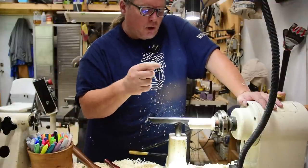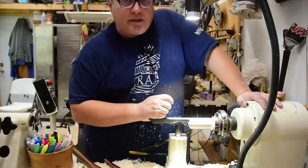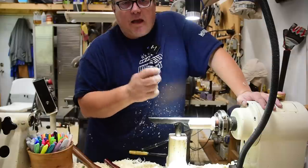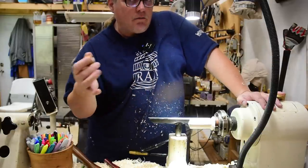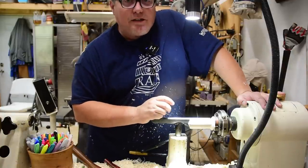Sometimes I'll grab some sandpaper and just kind of rub off the tip a little bit — you want that tip to be flat or slightly curved but not pointed at all. Then a little 400-grit to smooth out the last bit, and we are pretty much done. So as a review, I'm going to turn one at somewhat normal speed, maybe talking along as I go so you can see what I'm doing. I'm not an overly fast turner, but if you make a few hundred of these, you can get your speed down and have stuff to sell.